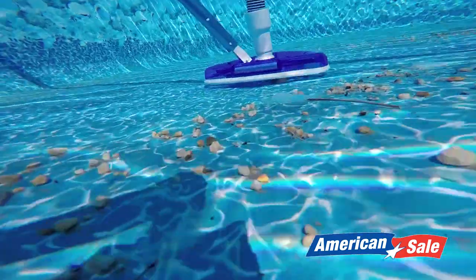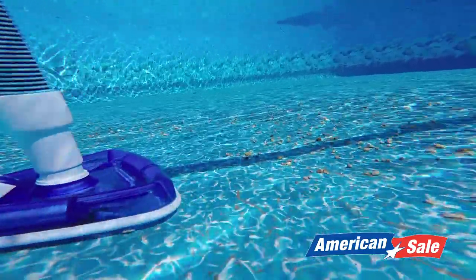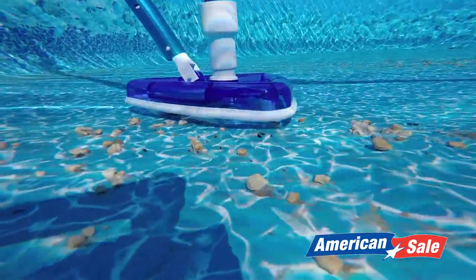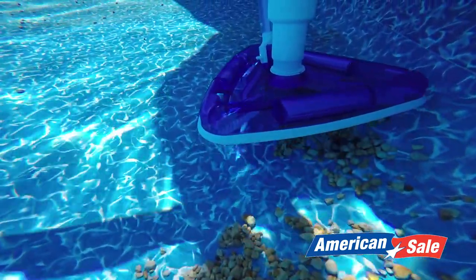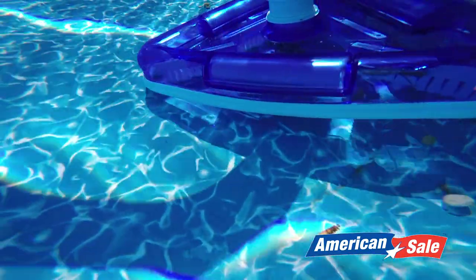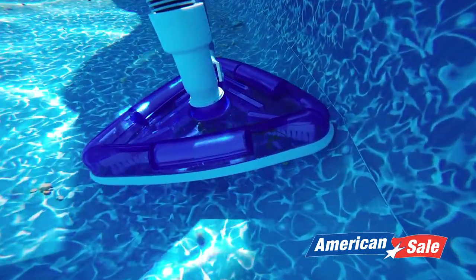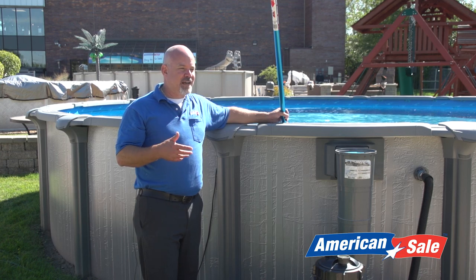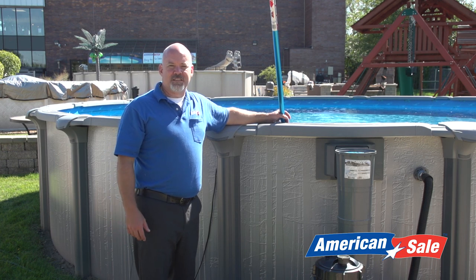While you're vacuuming, there are a couple of methods I recommend. For a round pool, cut it into pie shapes — work from one end to the center and back, like a slice of pizza. For an oval or rectangular pool, work one end to the other and go back and forth, or go to the center and then work from the outside in on the other side, so you're vacuuming on the way there and on the way back. It's very important to move slowly with the vacuum head — if you move too fast, you'll just stir up dirt and debris and cloud up the water. It's actually a relaxing experience; just take 15–20 minutes, enjoy the nice weather, and push that pole around. It's really rewarding when you see how good the pool looks when you do it nice and slow.